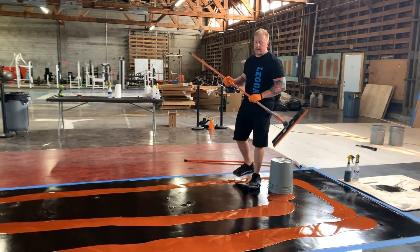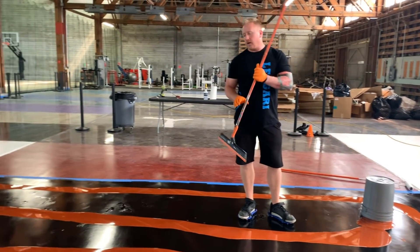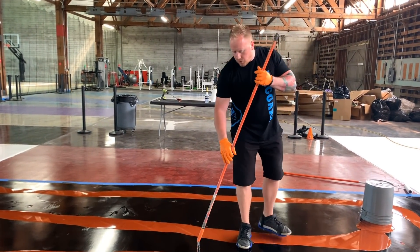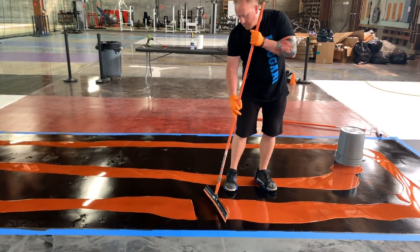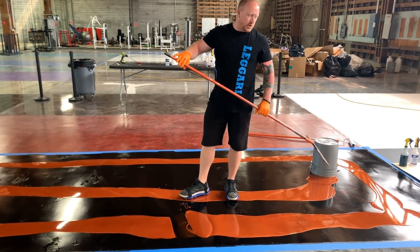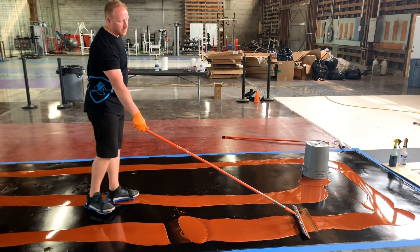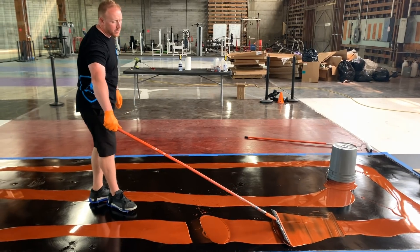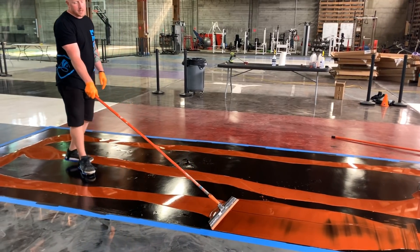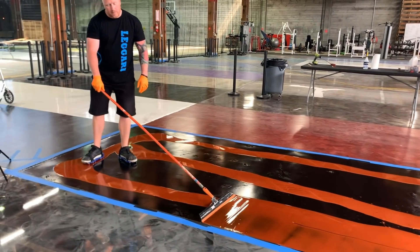So what I want to do is take my squeegee. Obviously you're going to be doing this a lot faster than me — I'm going to be stopping and explaining very carefully, otherwise we could just blow through this very quickly. What we want to do is take the squeegee — we're not going to push down like we're squeegeeing water and moving an entire pile. I'm basically going to let the weight of the squeegee, maybe give it a little bit of pressure every once in a while, and the angle, just move this whole pile. So I'm going to set it down at a 45 degree angle — probably a lot lower than that actually — and just get it right to the edge or right before the edge. We don't want to lose a bunch of material underneath the wall or onto the tape.